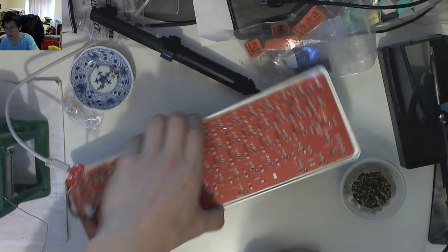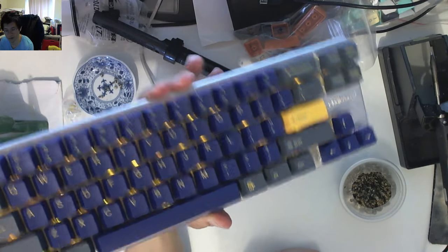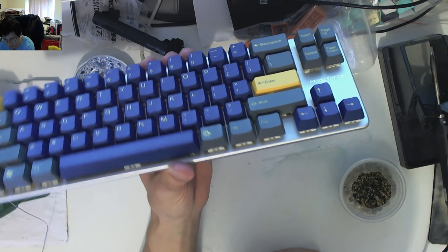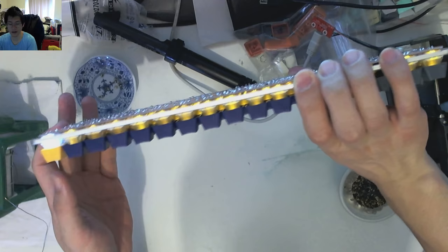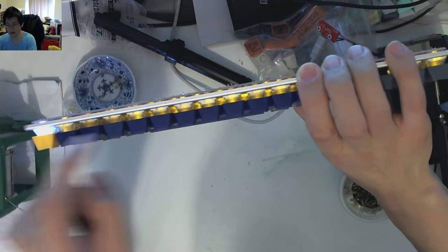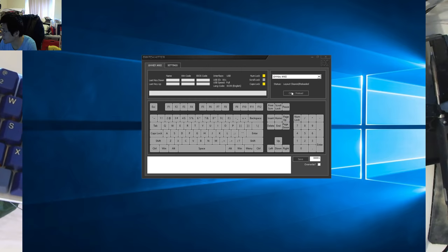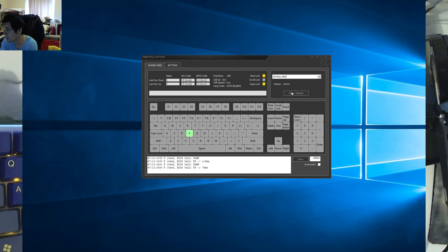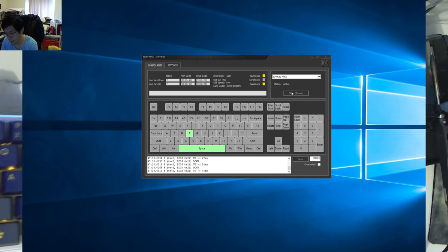Temperature is back up — let's get a lovely join. So there we have it — the F key is back hopefully in action. Let's give that a couple of seconds — and now it's nice and smooth again. We'll put the keycap back on. It still fits really snug, so I'm not too concerned about that at all. Now I've got another USB cable, so let's plug this in. The LEDs are on — you can see some yellows. The F key is now working really well, but Enter is still no good and left arrow is still no good. Reflowing did not fix the Enter key.